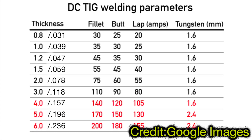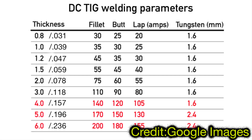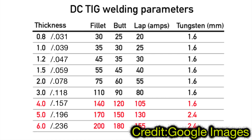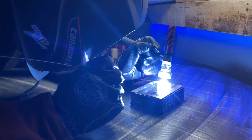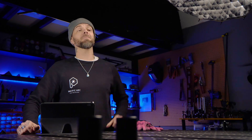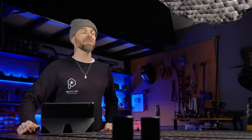Take a quick look at this reference chart — this is basically a set of recommendations for settings for stainless steel TIG welding. This should give you a rough ballpark of where to start as far as how much amperage you actually need. While I do use this as a reference sometimes and send it to people who need help getting set up, honestly there are too many variables that can change the way these settings perform with different joints. What position are you welding in? What size filler material are you using? All of these things can make settings like this not perform so great.